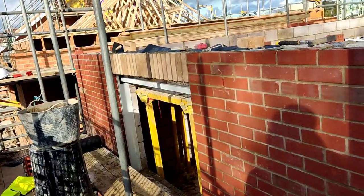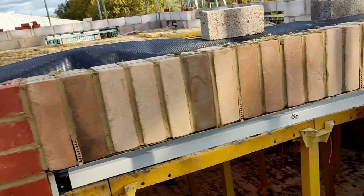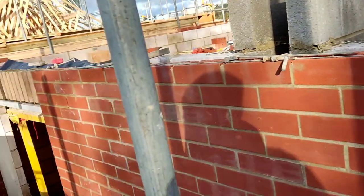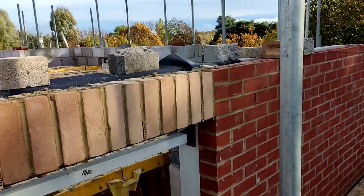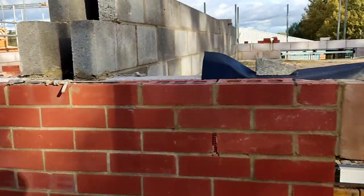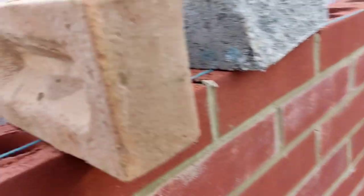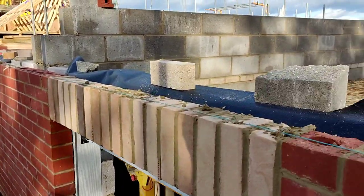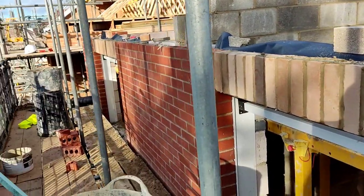Done two openings and soldiers - took me exactly an hour. Really easy with all the prep. It's easy when you're not having to find your lintels while building your brick shell on the fourth lift. Best to leave your top three courses unbooked - when you come to do your soldiers you've got a full three-course hole to work in. Only 50 bricks and it took an hour, not bad. Still got three more openings of soldiers and then we'll get on to another plot.